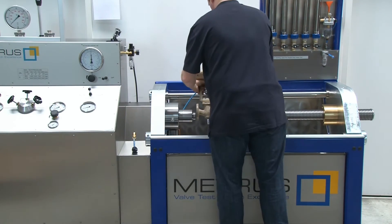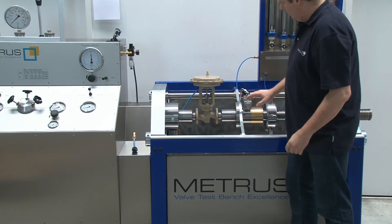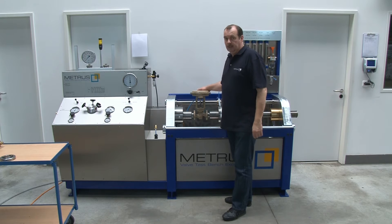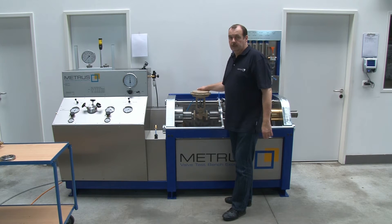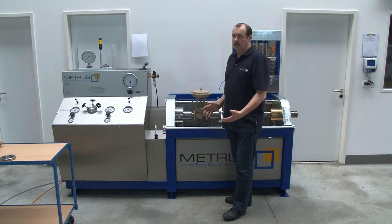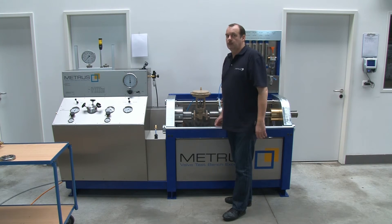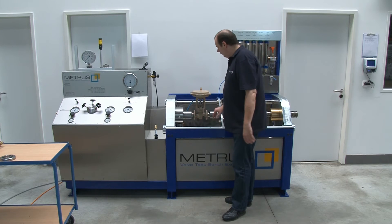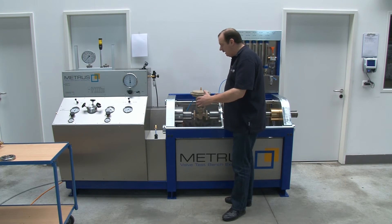Place the valve into the clamping area and tighten it manually, just slightly by hand — no need to force it. The force will be provided later by our automatic sealing heads. As you can see, I can still move the valve in the clamping, meaning there is no abnormal force on the flange side. Some other valve test bench manufacturers use hydraulic clamping, which clamps the valve without pressure inside and may cause changes in the geometry of the valve seat area, affecting the measuring result. In our case, the automatic sealing heads increase the force very smoothly and softly with the increasing test pressure, so everything is balanced and you never get abnormal force from outside.